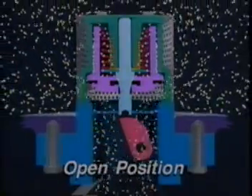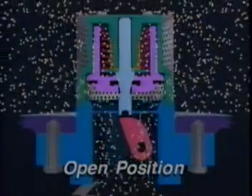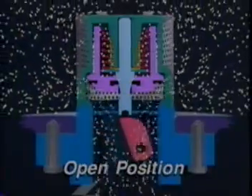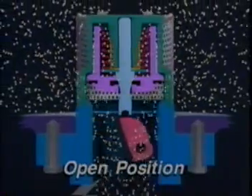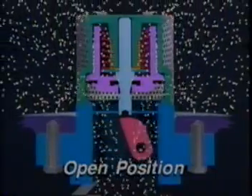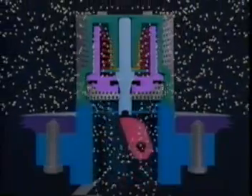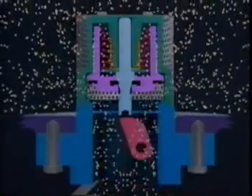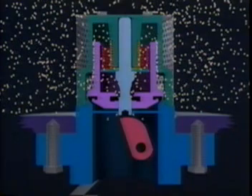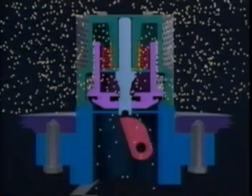The poppet will not open unless the valve outlet piping is closed, allowing the outlet pressure to equalize tank pressure. When a demand for gas downstream is created, the valve provides maximum flow and optimum flow rates. The entire opening action takes about 15 seconds. The valve must be opened before starting a pump. When opening the valve, if the cam is moved directly to the full open position instead of the midpoint, the gas bleeds more slowly, taking longer to equalize the pressure and longer for the valve to open.